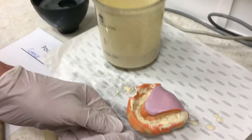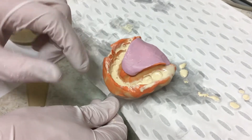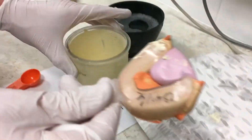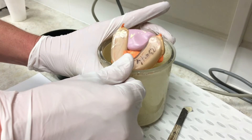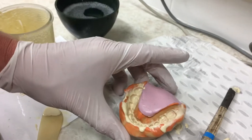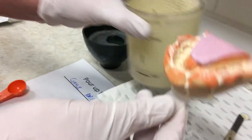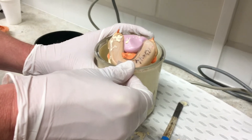We vibrate the stone back out and we're left with a very thin amount of stone, making it easy to see any bubbles. We continue to vibrate until those bubbles are gone. You can get a little plaster knife and poke any areas where you can see a bubble. This process we repeat until we're certain there are no bubbles — putting the stone in, vibrating it out, poking any bubble areas with the wax knife.